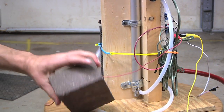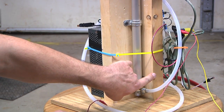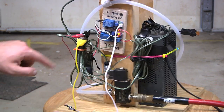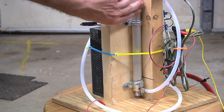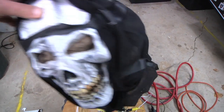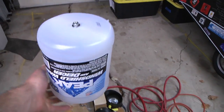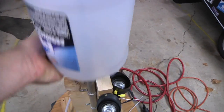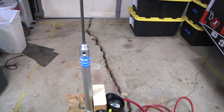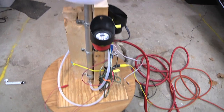Let's take a look at the air valve. I have a brick to hold the whole thing down. This is all built together on a piece of plywood, with two pieces of 2x4s coming up from it. I have screws on the bottom from the plywood up into these, and those two 2x4s are screwed together, making a nice corner to put the air cylinder in. I have that screwed in place using 3/4-inch conduit hold-downs. If I take the mask off, you can see it's just a windshield washer fluid container with a hole drilled through the top, and the end of the rod connects into there, so the rod slides up and down with the mask on top. The secondary air valve acts as an exhaust port when the head goes back down.